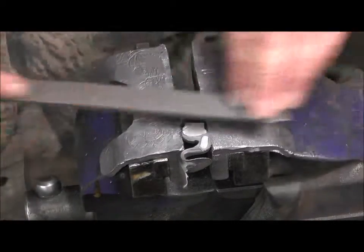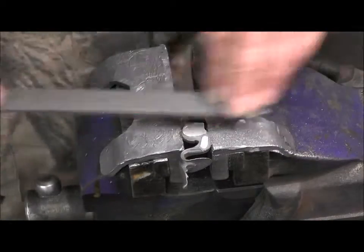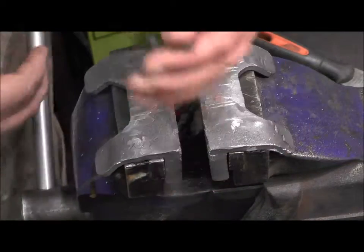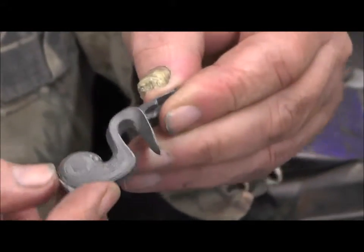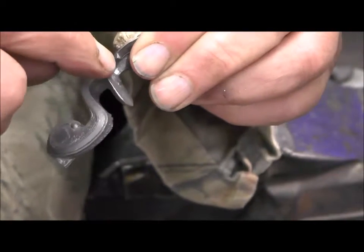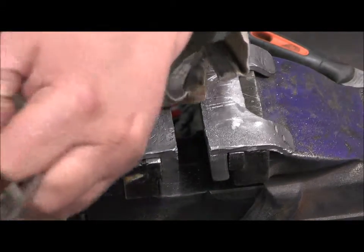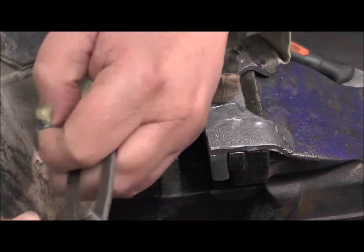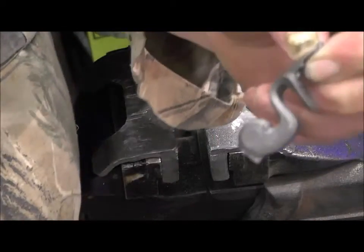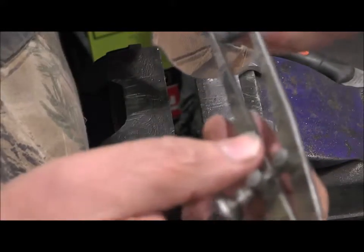There's lots of old gun books around. You'd measure it up. And if you were starting from scratch and you'd take the flint cock out of a solid piece of steel, you'd start off by drilling all the holes. Start with the center hole, that would give you your sizes, and when you measure the cock, it's what's called the throw on the cock. You measure it from the center of the hole, if I can show you this, from the centre of the hole to the top of the cock where the flint goes. That's what's called the throw.